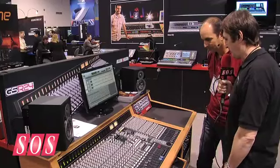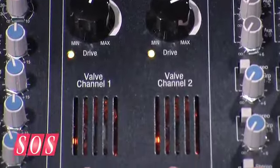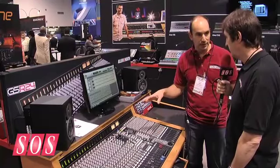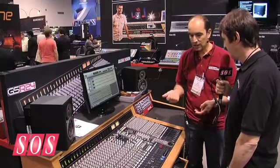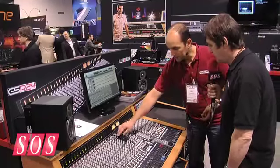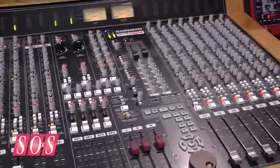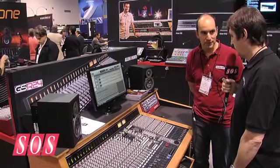You also have the valves in a couple of channels there to warm things up. Basically the channel preamps are so clean and transparent that I thought it'd be nice to put some second harmonic devices in there. There are a couple of valve channels, similar in concept to the GS3000, but the design is completely new. They can be configured as mic line preamps or guitar preamps. There's a 10 meg DI straight into a FET stage and then it runs through the valve. The drive stage sweeps between a solid state output and the valve circuit to add or decrease the amount of second harmonic warmth. It also has a digital source and a track output to the interface, meaning you can re-record an existing track through the valve stage to produce a warmer sound.